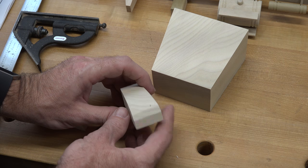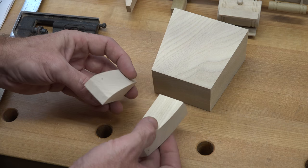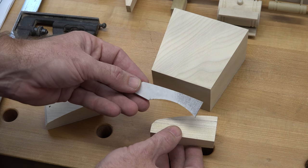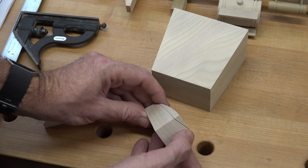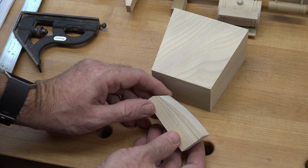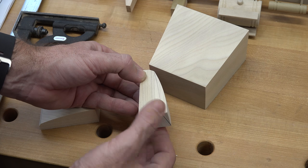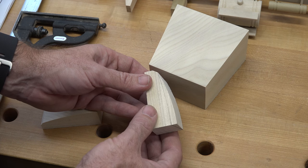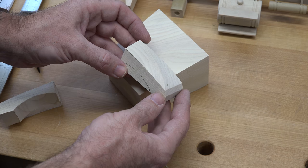Because it was on an angle and I needed it square to the front face, I actually left it on the scrap block while I sanded that chamfer. Now it's separated and I've used the next template — which the plans call step three — marking on the fenders the line I want to sand up to, which gradually meets the top edge of the fender. This is all sanding by eye; there's no technical way to do it. I take it to the belt sander and gently nibble away, watching my line on the end, watching my line on the side, making sure I don't cut into the chamfer — getting a nice grade up to the top and a nice curve to finish shaping both fenders.